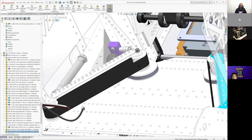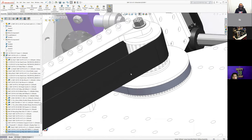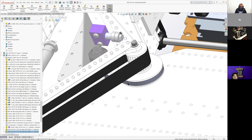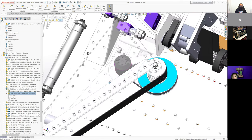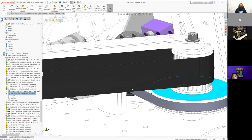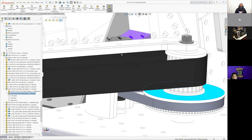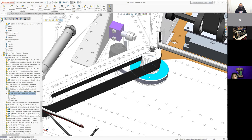But we did get some places where this belt tries to drive pretty low and starts marking up these pulleys. We were working on ways to fix that. In the future, we may print this up higher to avoid that, as we were getting some resistance there where the belt would rub down here. We also wanted to get rid of the weight of an extra planetary reduction or anything like that. There was some talk about using a NEO 550 into an UltraPlanetary. But because we're doing this dead axle setup and everything, we still knew we needed a belt reduction.